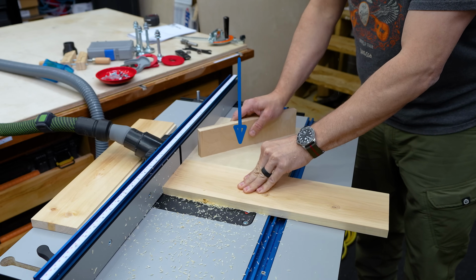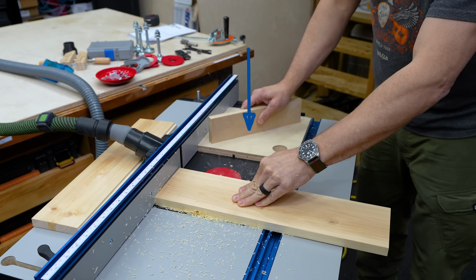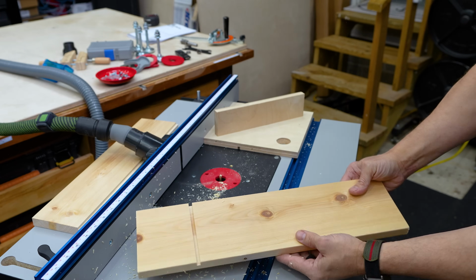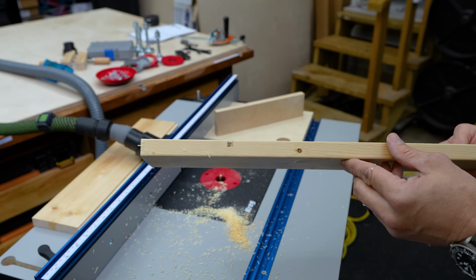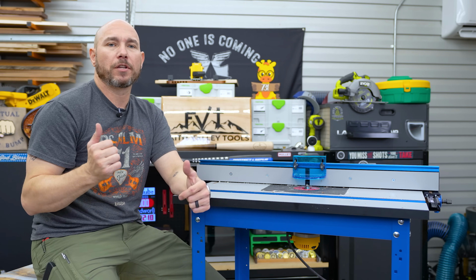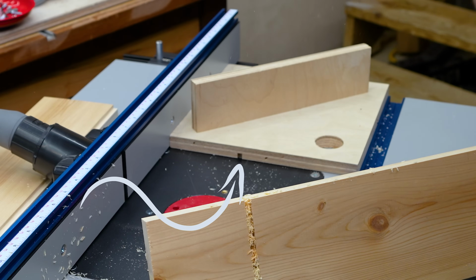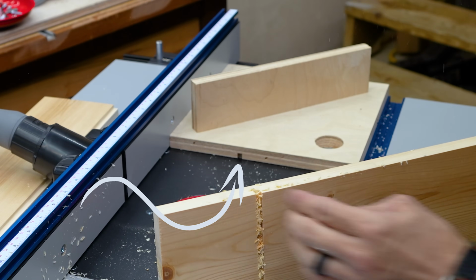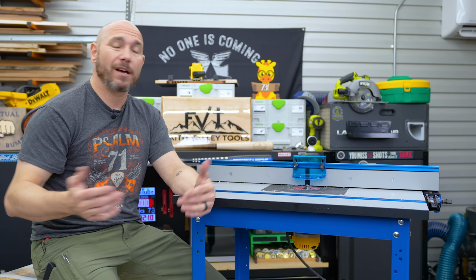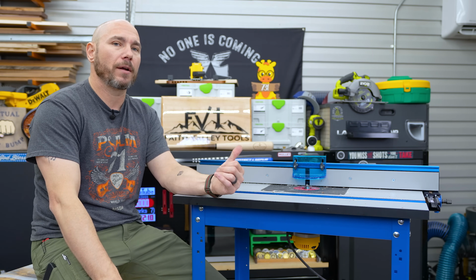You can use this little jig. It has a handle. It's just plywood, cut square handle. The holes are for extra clamping options. But you can just use this as your miter gauge because it rides against your fence. And remember, if your fence is square like this one, then all you have to do is push through the cut. And it also acts as a sacrificial piece after you go through the cut to prevent blowout. And so you can make a lot of really nice dados at any point across a board like this using that jig and a router table.